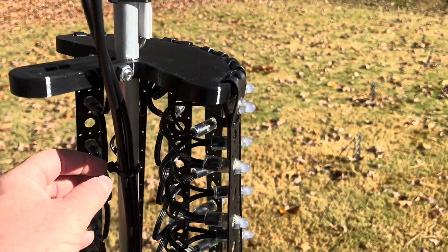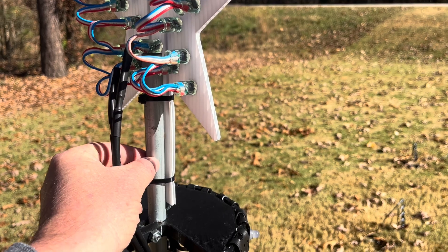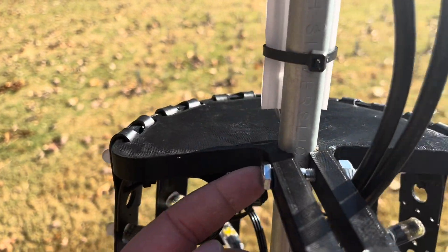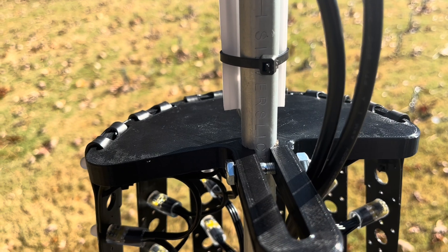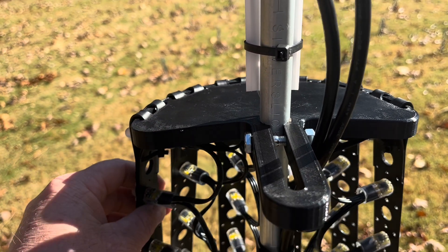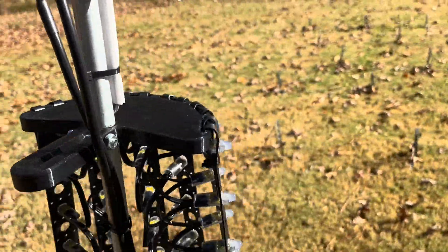This mounts to a five-foot tall half-inch EMT conduit, and I have a bolt hole designed into the fixture to clamp it to the EMT so it doesn't slide down, because these lights weigh a decent amount. The bolt clamps them together.